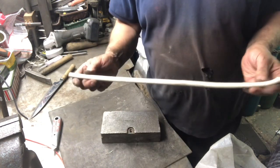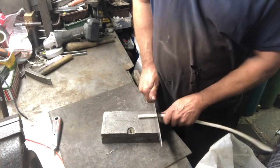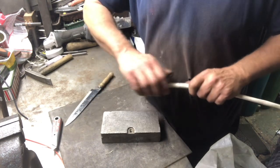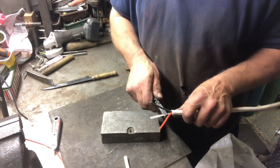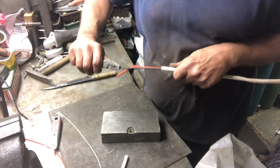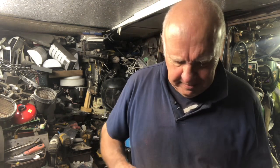Take a knife, go about an inch and a half to two inches in, just run it around and score it — you'll cut through it like that. Then just pull that off. Take your pick — I find the one without the sheathing on is easier. Take the pliers and just pull it out. With that done, you can just pull your other cores out. Voilà — how easy was that? They always say to make a hard job easy, give it to a lazy person.